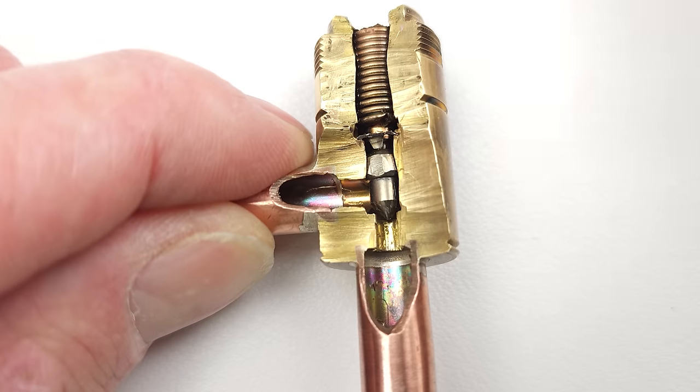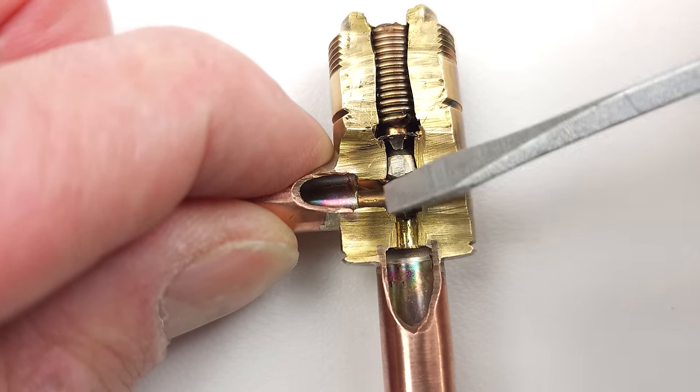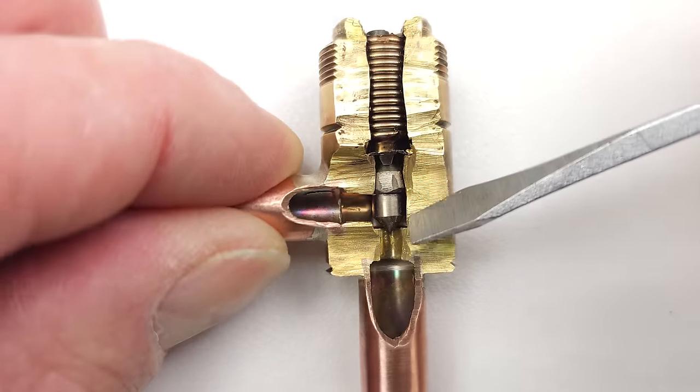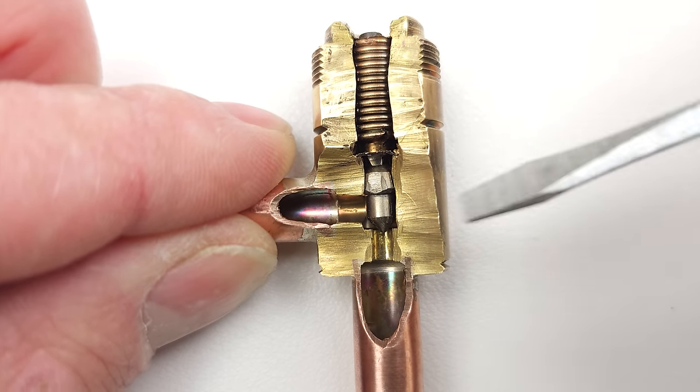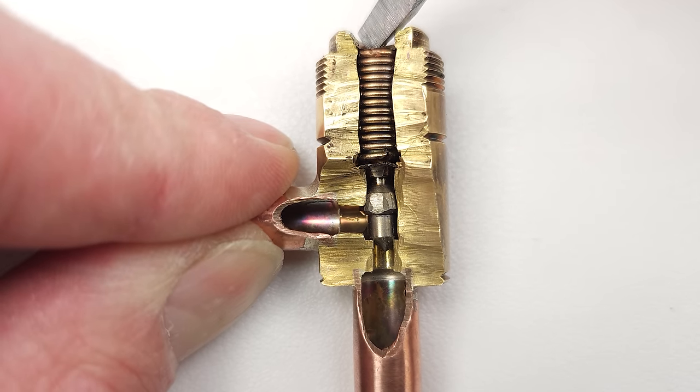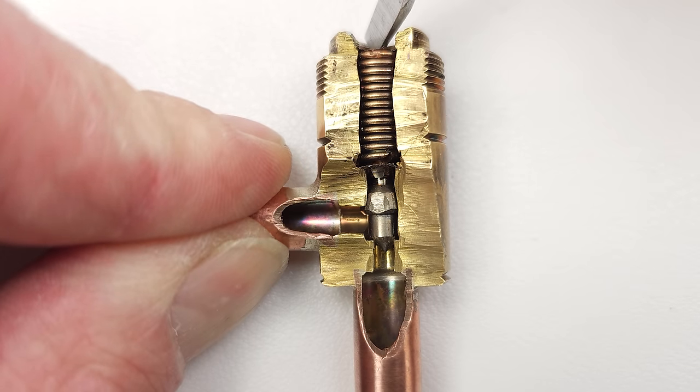This little pin right here is controlling the amount of refrigerant flowing through into the evaporator coil. There's a lot of control with this version of an EEV — it takes a lot of electrical pulses in order to move this pin position to adjust it.